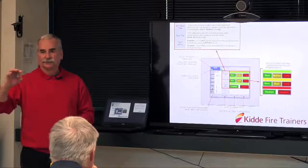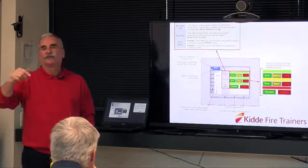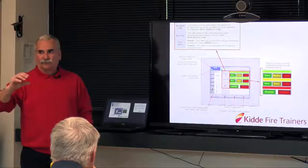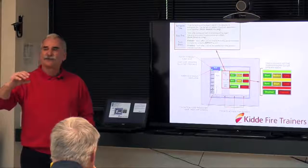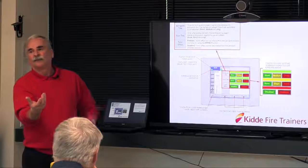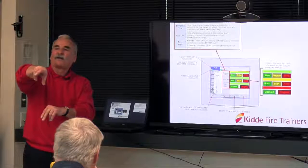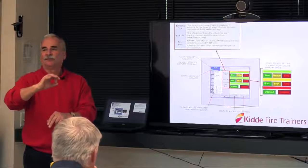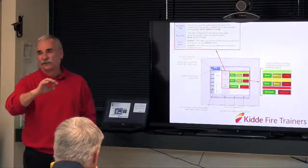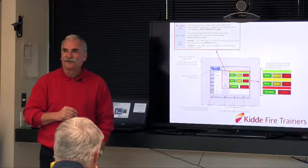The agent sensor is a little light that picks up the water flowing by it. Depending on how tough an instructor you want to be — if the light is at the bottom, it picks up water as soon as it flows. If the light is at the top, they have to fill the pipe with water before it picks up, making it even harder to put the fire out.